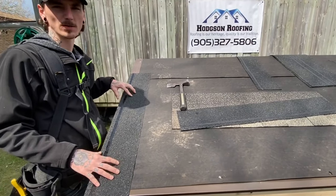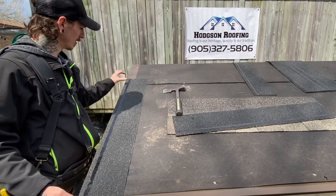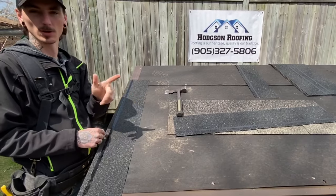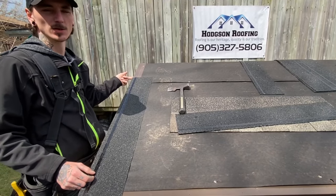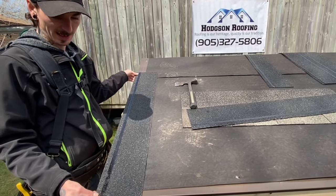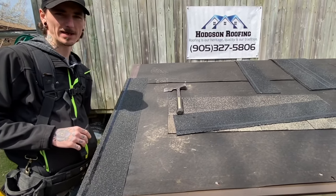When it comes to installing your first starter, you're going to want to start with your gable. You have a drip edge which is approximately one inch — or one knuckle for most people — inside the roof line. You're going to want to come off that about a quarter of an inch, and that'll give you your perfect spacing. Then you go ahead and nail that down.